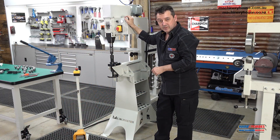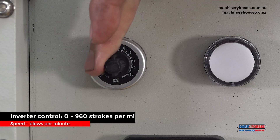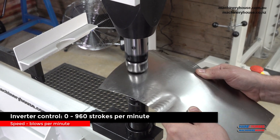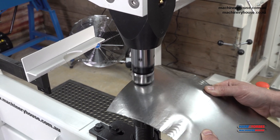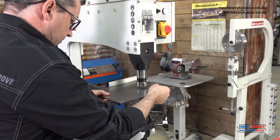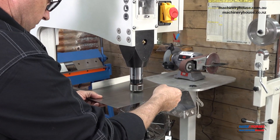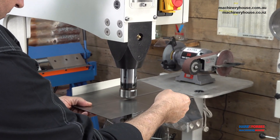Some of the features of the machine: you have variable speed. Variable speed is good for electric planishing or high speed planishing, and you can also use it for low speed on things like thumbnail shrinking dies and also joggling and stepping.